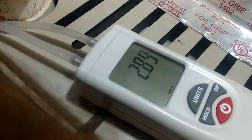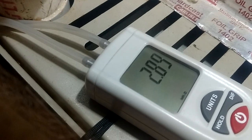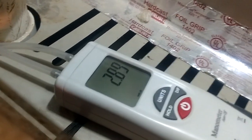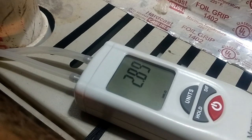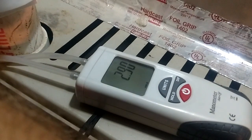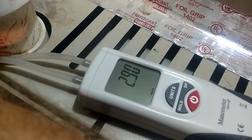Let's see what we've got. Oh guys, look at that — you couldn't make this up if you tried. You talk about accuracy. We were sitting at about 2.9, and right there is 2.9. Now don't tell me Chinese tools are not accurate. I have an old yellow jacket analog manometer in the plastic yellow case, one of the old ones from back in the day — it reads the same thing as this does. And I have another digital manometer that also reads the same. But right there is the proof: 2.9, exactly what this thing was reading.